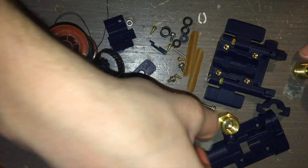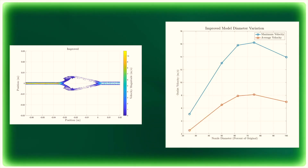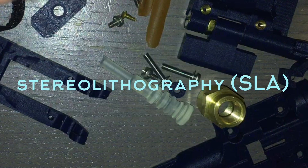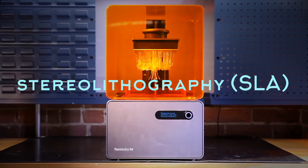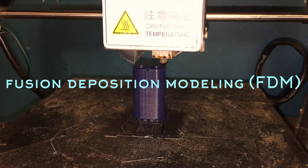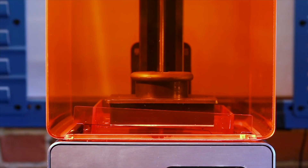The next thing you're going to do is prepare the valve stem. I've done a lot of research on it to optimize the flow rate of the web shooter. This version is simply an extended version of the original design by the Human Spider. Both the Human Spider and I have found best results when this part is printed using stereolithography — those special photopolymerization printers that solidify resin using light. These largely decrease the surface roughness associated with 3D printing, which prevents web fluid from bonding to this component and prevents clogging. That said, it doesn't require very precise tolerances, so you can try printing it using FDM, or traditional 3D printing. I can't guarantee it'll work more than once, but it's worth a shot if you don't have an SLA machine.